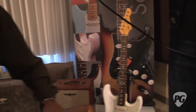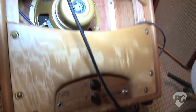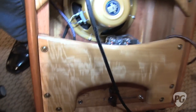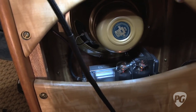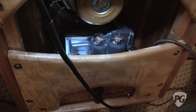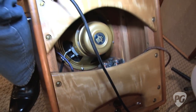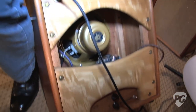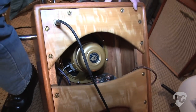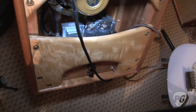You have to turn it around to see the knobs. Basically you have a volume and a tone, done in the old style from back in the 30s and 40s. The amplifier is nestled inside and it's convertible — you can swap the power tubes to determine the output wattage. In this case I'm running a pair of Mullard EL37s, getting close to 25 or 30 watts output, cathode bias.